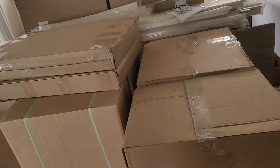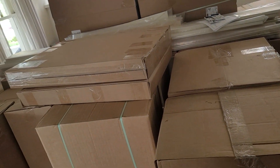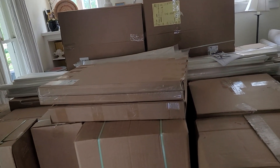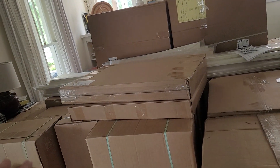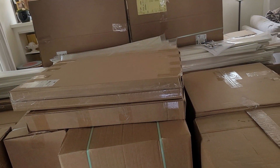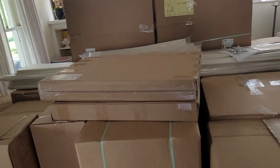This is the preferred way of stacking when you deliver. You want your base cabinets in the back, your tall cabinets in the back, all of your wall cabinets in the front, and your crown molding elevated up off the floor so you don't have problems with warping crown or anything like that.